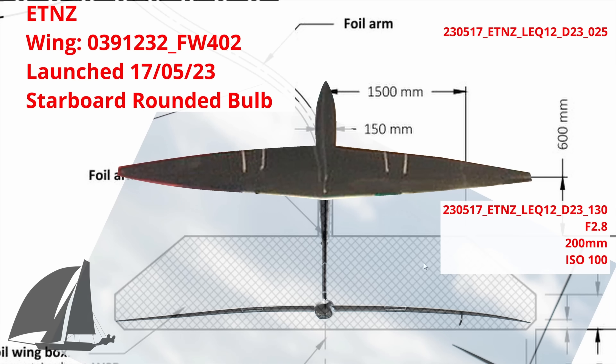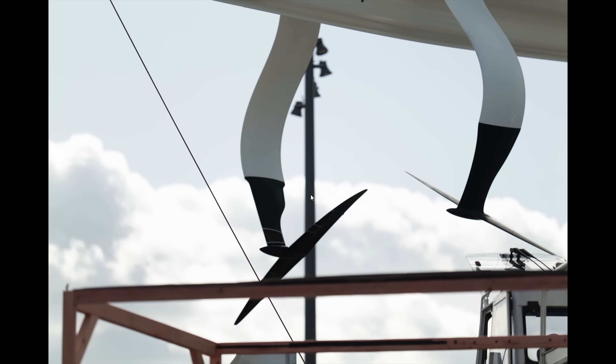There's no huge step down in surface area, no addition of wingtips, and some interesting features in terms of cameras mounted and these kind of matrix pressure sensing devices. What I find slightly interesting about this new foil is it's been launched on the starboard side — the banana foil was on the port side — so they've obviously gone back to testing this foil against the OneDesign AC40, probably as a more known value, which maybe makes sense if they have better data. The OD foil is simpler, so perhaps it's easier to extract information in a comparison.